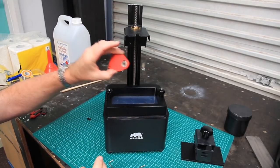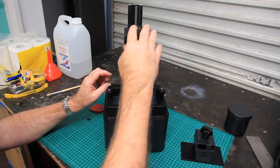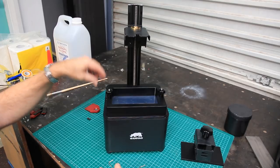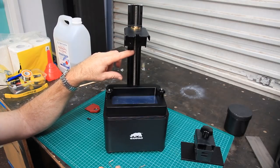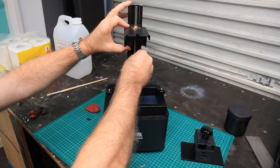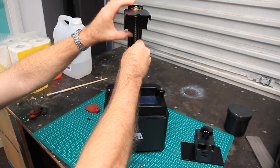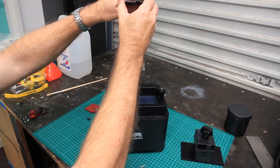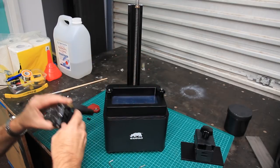This was still installed, and I did manage to crash the platform bracket here into this, which would have put some strain on the lead screw. These are quite easy to bend. I didn't think they would be easy to bend, but they are quite easy to bend. So what actually happened was, I think if it wasn't bent before, it was definitely bent after I did that. So I took this apart so that I would not run into the Z-axis wobble problem, because that was going to cause some real problems with the printing I was doing. Okay, so